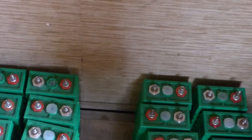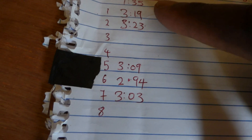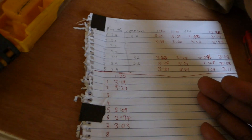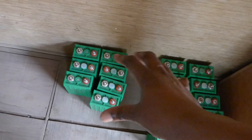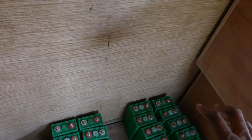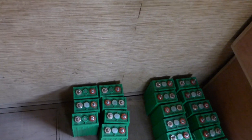I tried discharging them using resistors — 25 watt, 2.7 ohm resistors, three on each — and let them sit for about three hours but wasn't having much luck. They got very hot and came down to 2.9 volts. The cell readings were 3.19, 3.23, 3.09, 2.9, and 3.03. When I started charging back up, one battery ran off while the others were stuck at 3.30-3.35 volts. These are almost $1,700 worth of batteries before shipping, so I really need help getting them into my system.